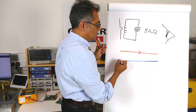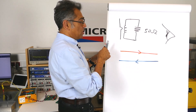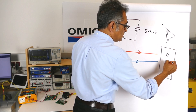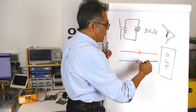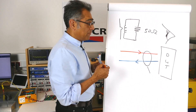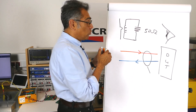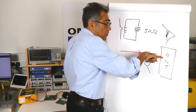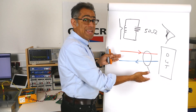Imagine that you have got two cables: on one of them current is going in and on the other one the current is coming back out. This will be differential mode current going to your device under test. You put the clamp around these two cables and that goes to the spectrum analyzer. If we had a perfect cable with 100% coupling and absolutely no leakage, then all the current going one way would cancel all the current coming back, and therefore there would be no field — you could not pick anything up.